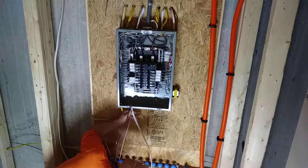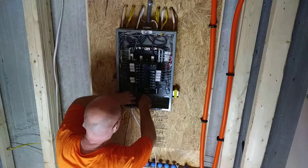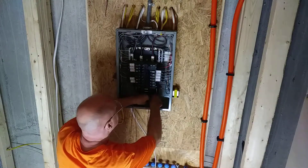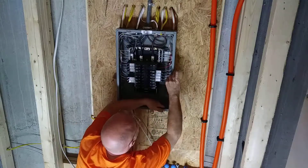Make sure my Romex connector is not pinching the wire. We'll get our ground wire in there first, push it down to the back, right across the back here, come up and find another one.